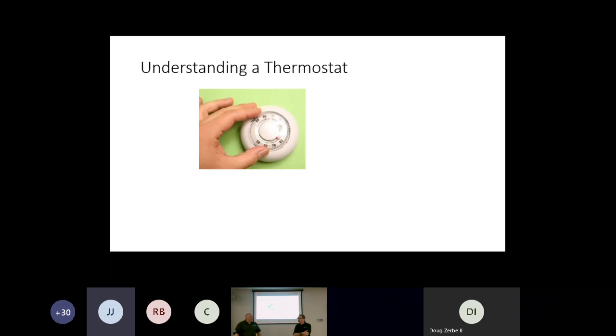Correct, but I will tell you that in addressing that question, if you were to get a Smart Lock, and it's not an advertisement, but there is something called Smart Lock, and I don't know if you can see that. That Smart Lock does have what they call a swage to pipe. So if you have a 7/8 fitting, it's going to be a swage, which goes over the bell, and then allows the pipe to go in.